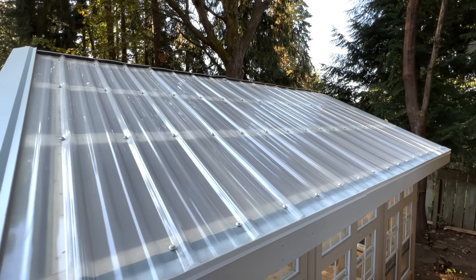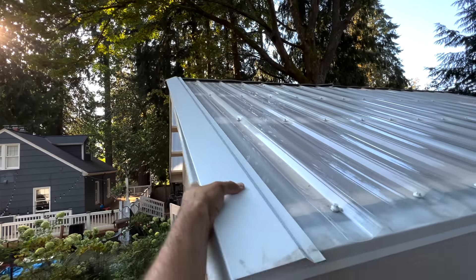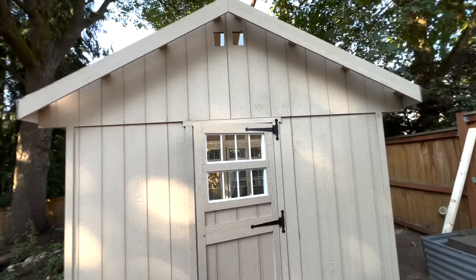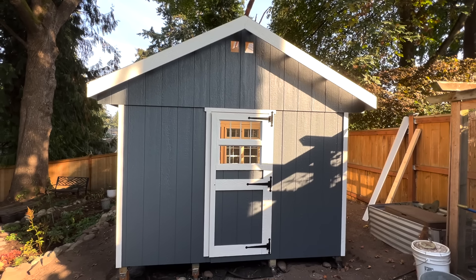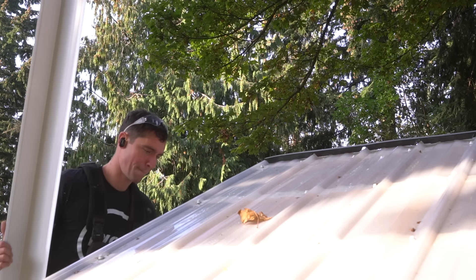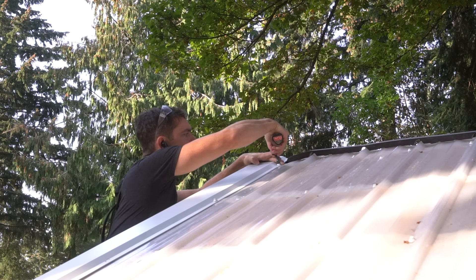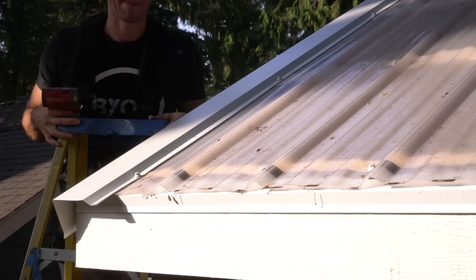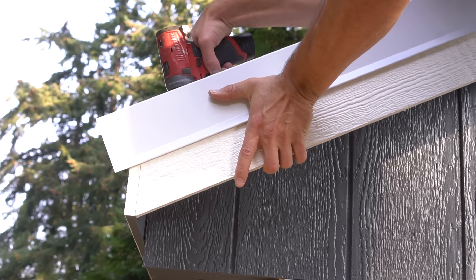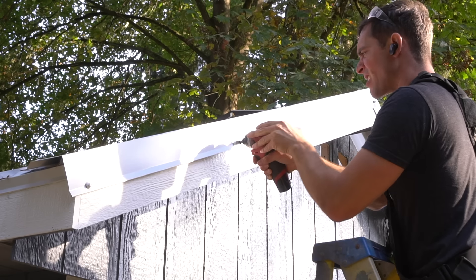I am really enjoying how this roof system turned out — all those gaskets are perfectly aligned and in place. I still need to put in our side flashing right up against our fascia. Before we do that, we might as well paint first. It really does make life a lot easier if you paint your fascia boards before you apply your metal flashing, because it's a lot easier when you're trying to roll it on versus using a paintbrush and delicately getting underneath your drip edge. I'm using the same specialty fasteners with a gasket that I used previously with the roof panels — applying a fastener at every single 2x4 location, and then at the front of our drip edge I screw both ends down properly and apply a few secondary fasteners every 24 to 26 inches across.